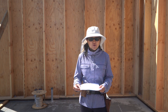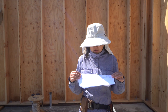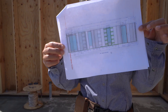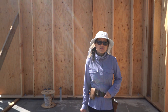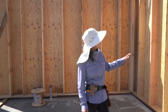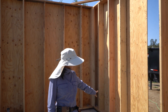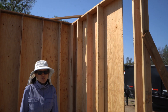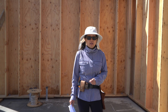True to ourselves, we had a very detailed drawn plan. This is our framing plan, which we've done in the computer with a lot of details and all the dimensions. We decided to do this as opposed to just figuring it out on site, to get things done quicker and to think through all the details. For example, we've decided to come back and fill the headers later, but we wanted to make sure we leave enough opening and not have to do the math on site — having everything drawn out in advance so we can go straight to cutting and wall assembly.